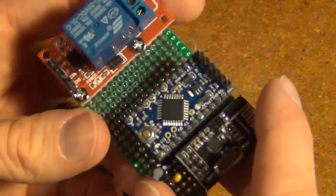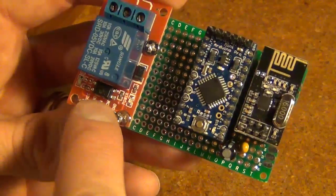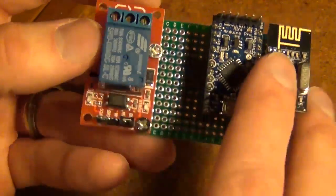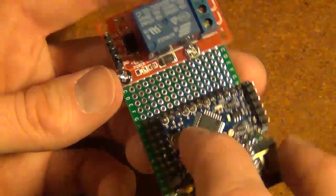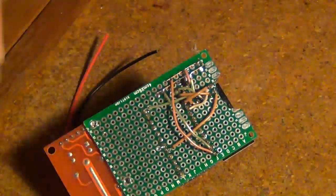So right now I'd normally test if I was building more components into this board, but because I'm only putting on this relay, I'm just going to solder in these last 3 wires to my power end to the pin 3 of my Arduino, and then test from there, since that's all we need to do for this program. Then we can upload and test it.